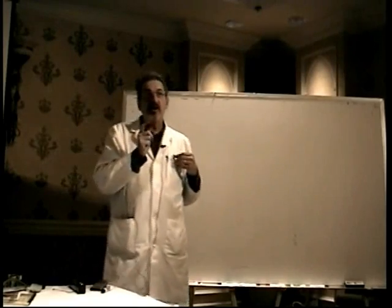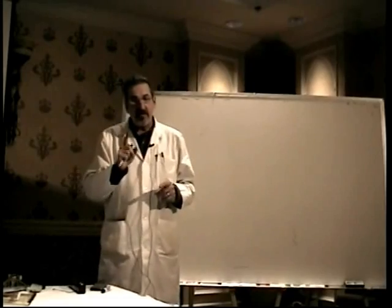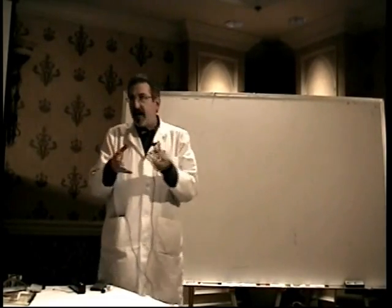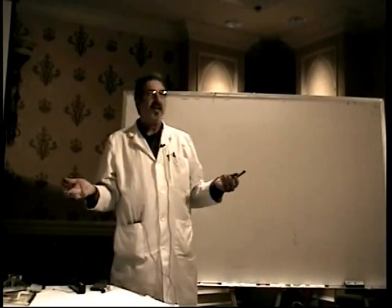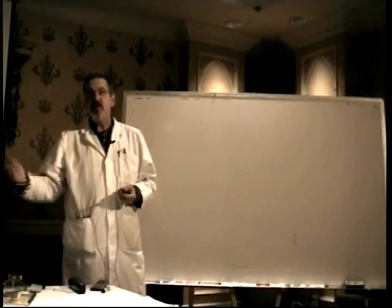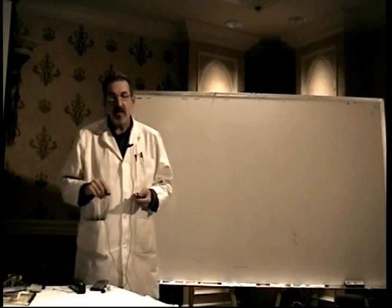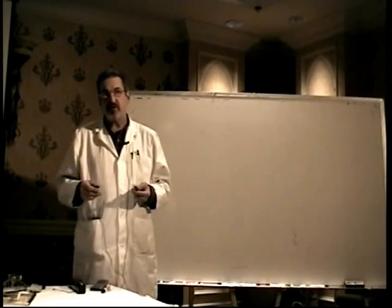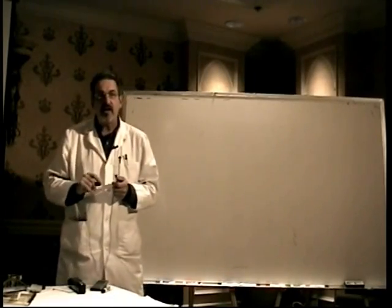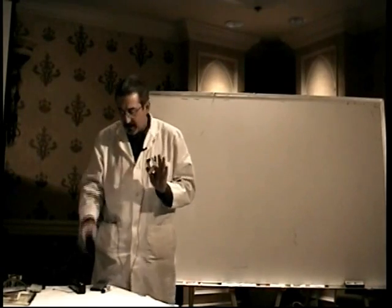Honestly, sync failures are not particularly common in most monitors. However, and this is kind of an important thing on the Cortec monitor, every monitor has its own unique little failures, these little idiosyncrasies, and once you learn them, man, you can go right to them. You have Cristal monitors that are blowing horizontal output transistors, which we'll look at in the next segment, and you replace the horizontal output transistor, and you always replace C609. Little tricks like that. I'll cover that one. Don't worry about it. And so this one also has a common problem that I want to point out to you.